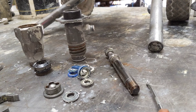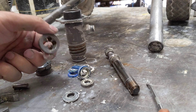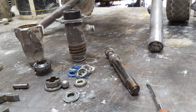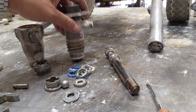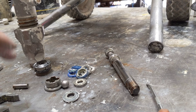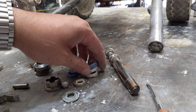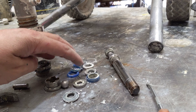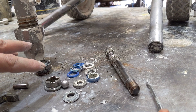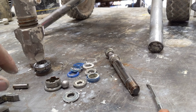So that's what we look for when we're opening up these pumps. We're not just willy-nilly saying change this or change that — everything's checked first, cleaned, checked, and then we give you our recommendations. A Graco pump like this is usually good for anything from 5,000 to 10,000 litres, depending on how it's used, what product is put through it, and what PSI. That's the way to pull these apart. It's really good to know what your pump looks like on the inside. Regarding buying a kit and reassembling these yourselves — if you have the knowledge, by all means do it. If you don't, please don't, because you will only do further damage. At the moment the damage here is purely packing, but if you don't know what you're doing you'll do damage to the metal bits, and that's where the pumps become expensive to replace. Ali from Westspray — look forward to seeing you on our next one. Take care.